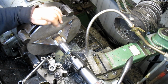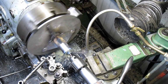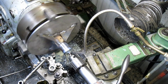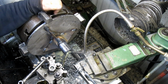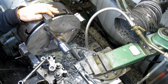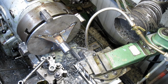All right, now we've come to the stainless steel part, which is this plate, and we need to slow way down and cut it very slowly. All right, that's all we're going to do for now. We're just barely punching through. Actually, I should have stopped a little earlier, so that the oil doesn't go through and start spinning out around the other side of this plate. So let's go to the next size. Shouldn't be a problem. Let's speed it up just a bit.